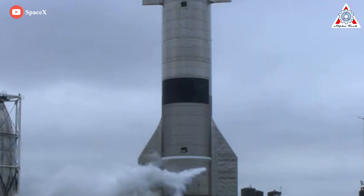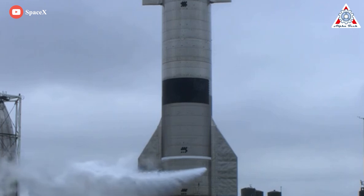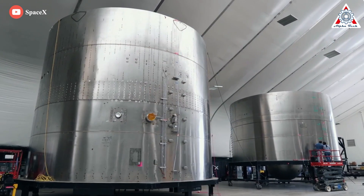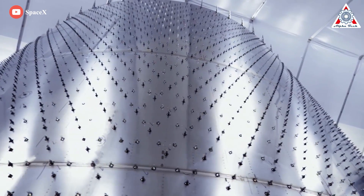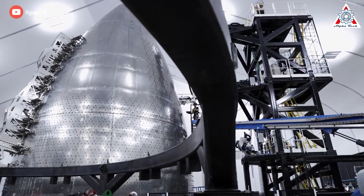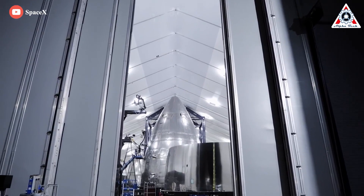The process, formerly known as dual shield welding, was primarily developed for the welding of structural steel. The most commonly used shielding gases are carbon dioxide or blends of argon and carbon dioxide. The most frequently used blend is 75% argon and 25% carbon dioxide.